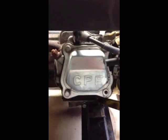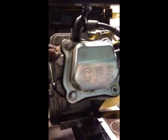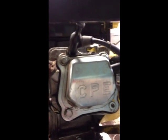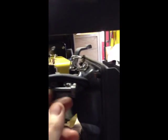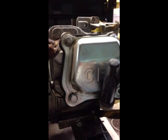Annual maintenance requires you to adjust the valves, and to get to the valve, this is the valve cover. To remove the valve cover, you've got four bolts. One, this one's removed already, two, three, four. First, pull the air hose out the back, like so, it just pops out, and move the spark plug wire out of the way, remove these four, and expose the valve.